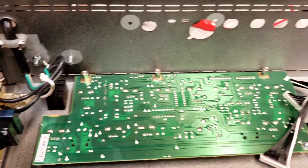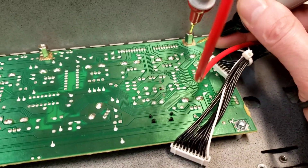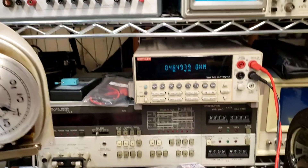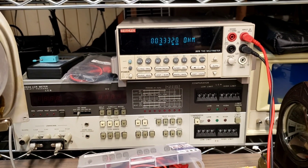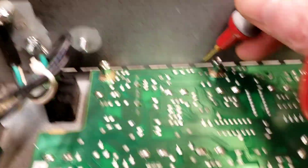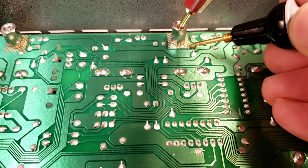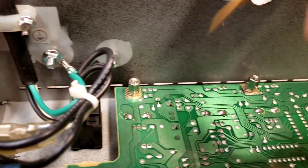Let's take a look. I'm going to measure the ohms between the top of the stud and the copper pad that it's mounted to. We've got three point three ohms — from just there to there, 3.3 ohms. That's a bit of a problem. Let's take a look at this one — from there to the copper pad — oh dear, five-point-something kilo-ohms from there to there.